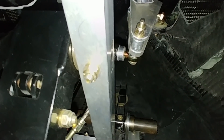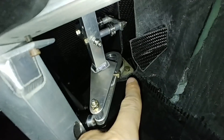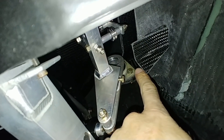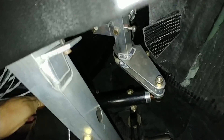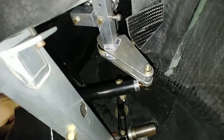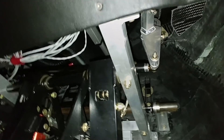Here's the one on the other side — same deal, all bolted up nicely. Those aileron connecting rods have got the movement they're supposed to have with the rod ends. There's the other bracket I bonded in for where the stopper is, so when I push it you can see how it'll go and touch on there for the stop. You can adjust the length of that bolt.